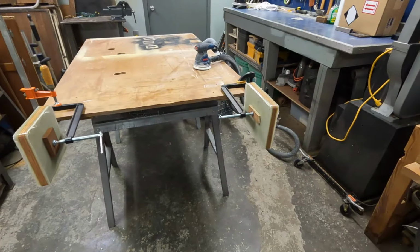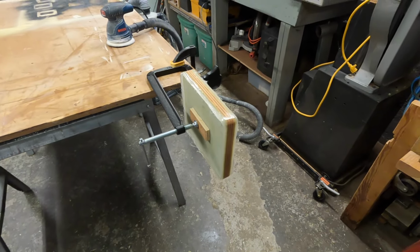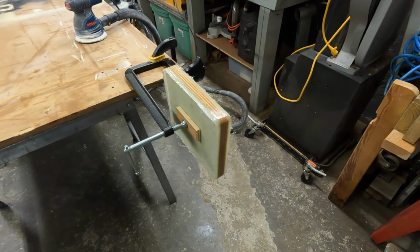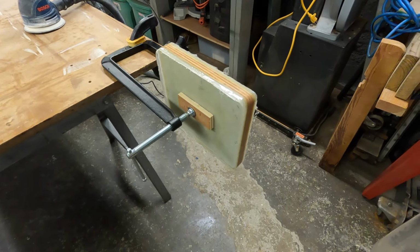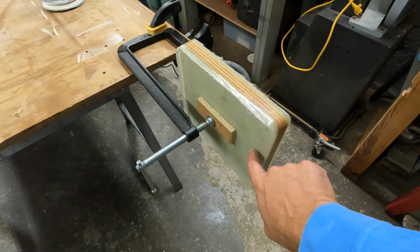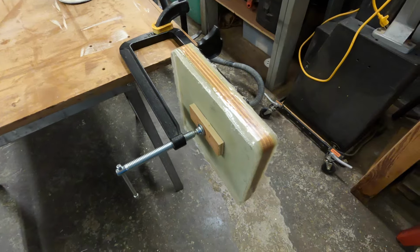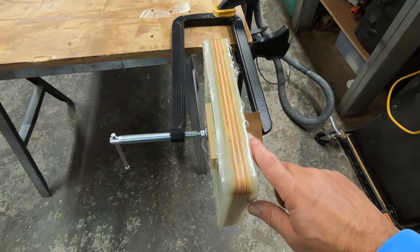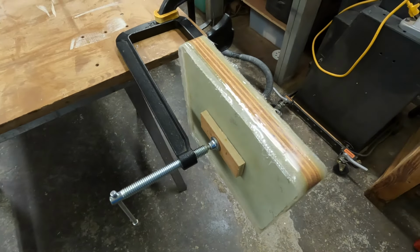Well, I've been working all week at night after work on building these, which I'm going to call plates. They're actually going to be mounted horizontally, and that's where the rudder shaft will poke through, and these will hold up the actual rudders. Built them the same way I built the vertical pieces that I had already installed on the boat: four layers of 1708 on each side, and then two layers of this thinner fiberglass on the edge.